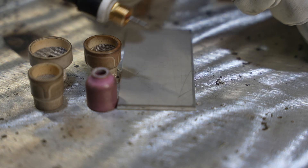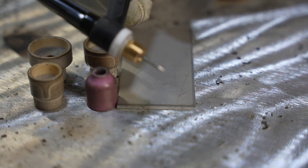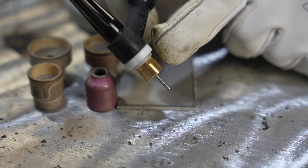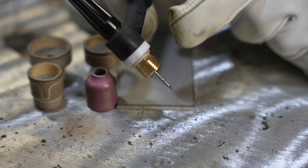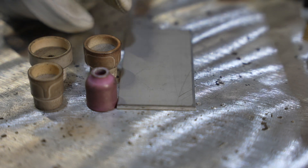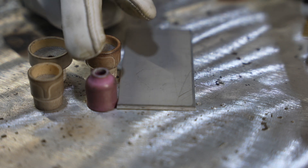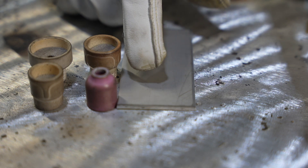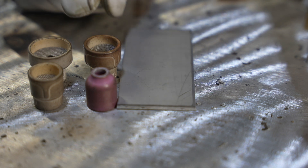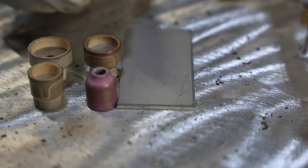For that reason I go with the standard collet body — it doesn't get gummed up with debris. Now I have some 1/8" stainless steel here and I've switched over to a gas lens. For DC welding on steel, stainless steel, titanium, I pretty much always use a gas lens. On the larger style torches I use a stubby style gas lens with these same cups. I'm going to show you using a small number 5 cup on stainless, then try it with a larger number 12 cup and a longer electrode extension, and see the difference.